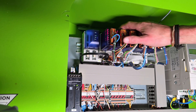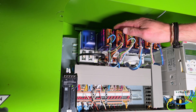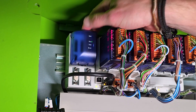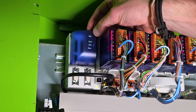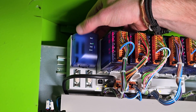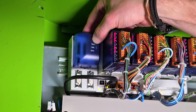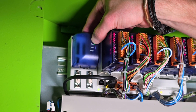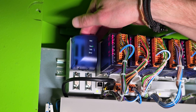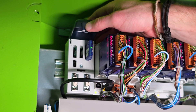Once you open the door, you're going to see your PLC board. I've got my cards here — blue cards, orange plugs. Just to the left of that is a blue cap. This has a battery run, halt, and error light on it. Right now you can see, because I've got power on — we always have power on when we're replacing this battery — I can see that the run light's on. I'm just going to push up on this cap and lift it up.